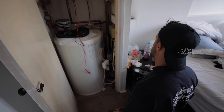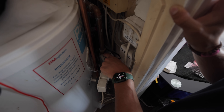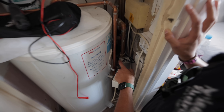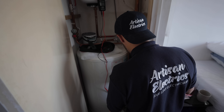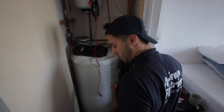This house is still being renovated at the minute, so that's off — that's fine. And then this two port valve here, you can see it's loose, which means it's open. You want to feel some resistance as you push it open if it was closed. I can feel the water running through there. What I'm going to do is check to see if this is wired up correctly, because it's only been added recently, so it's very possible it's just wired in wrong.